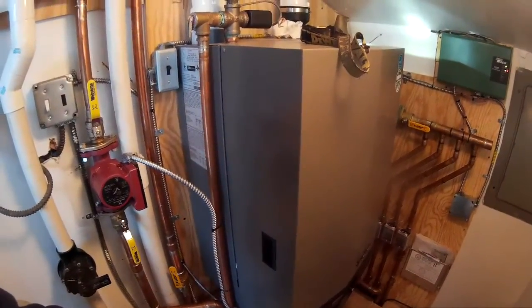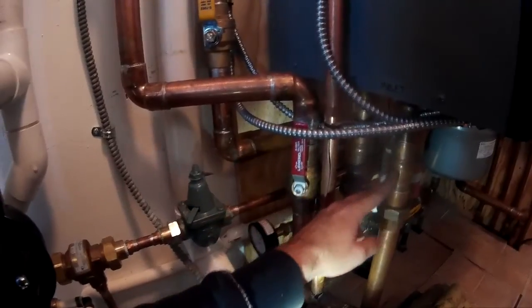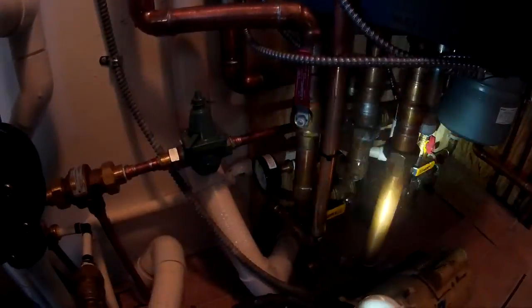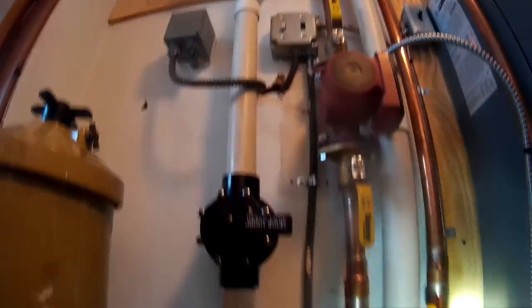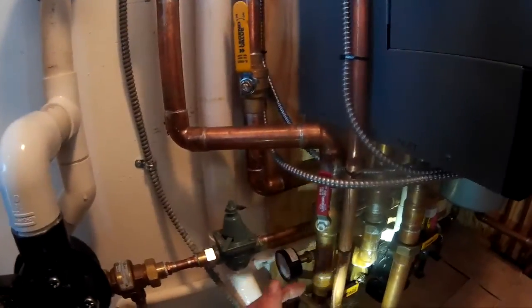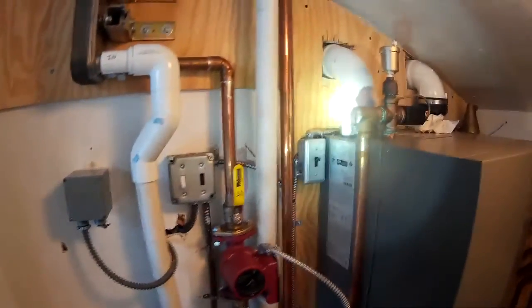I piped it in here — there's my inlet, so this is my return pipe. My supply pipe comes back over here, off my supply way back there — you can't see it. But when she basically flips that white switch, it puts it into domestic hot water mode and heats the spa water. It's the solution I came up with to heat the spa instead of putting another boiler in.